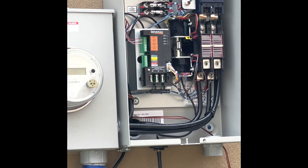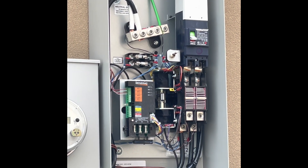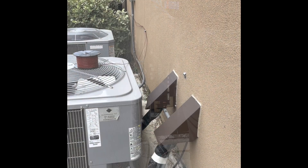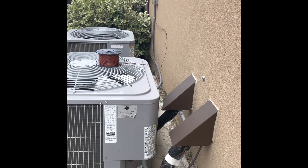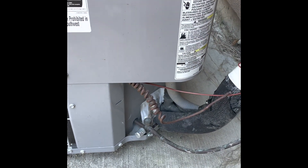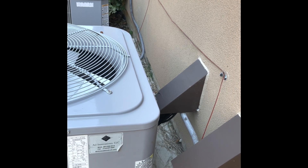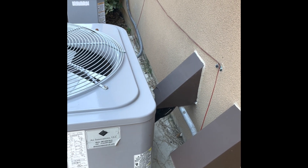All wired up, passing through to the box. On the inside: two hots, one neutral, and one ground. This is going to be a delay switch for both air conditioning units — a five-minute delay if they're on when the generator has to come on. The brown wire is the delay wire, wired in here for the AC units in case they're running when the generator kicks on.